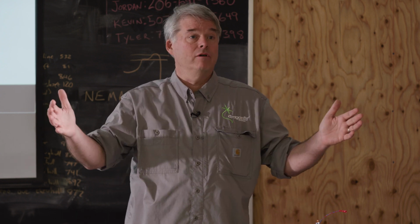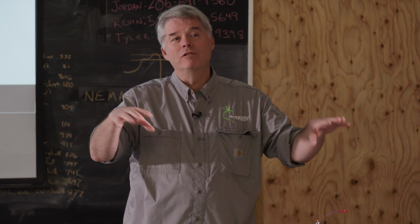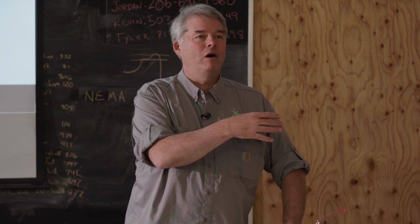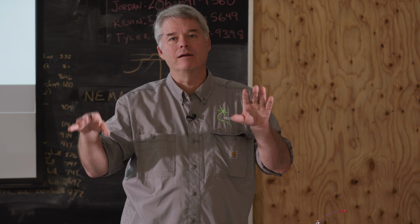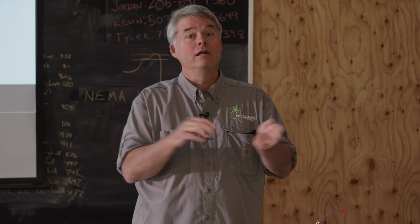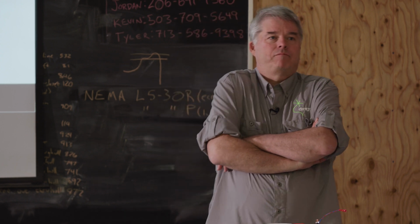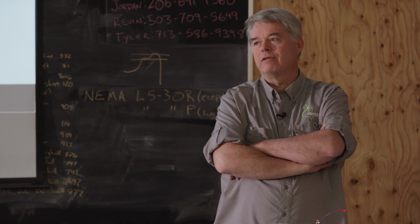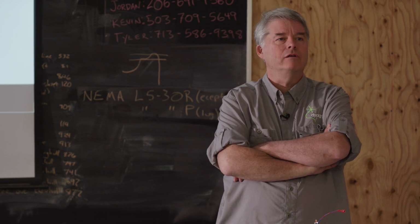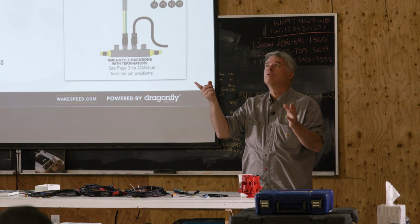The other thing that I actually learned here just a couple weeks ago: when you've got a large number of lithium batteries in parallel, they'll all be their own overachiever. And you could find up to a 10-degree delta on the positive post between different batteries, depending on where they are in their own balancing and state of charge. This actually came about because it was a customer in a van in the desert. And he said, God, it's hot out, but it's not that hot and my battery isn't charging. He was at around 30 degrees centigrade.